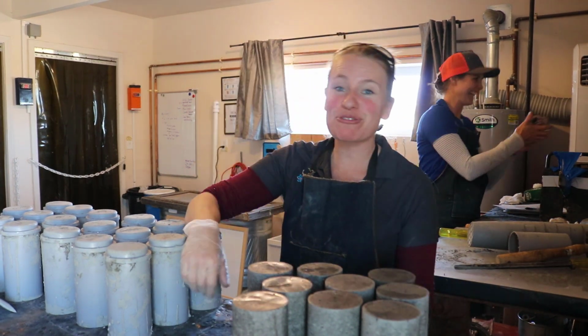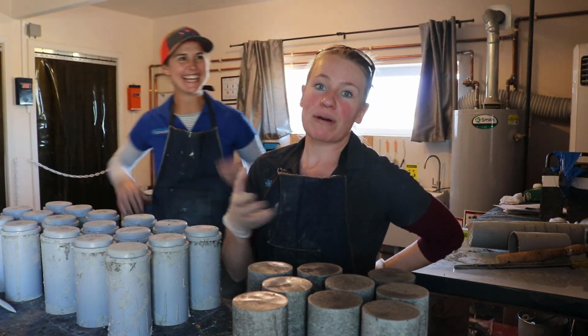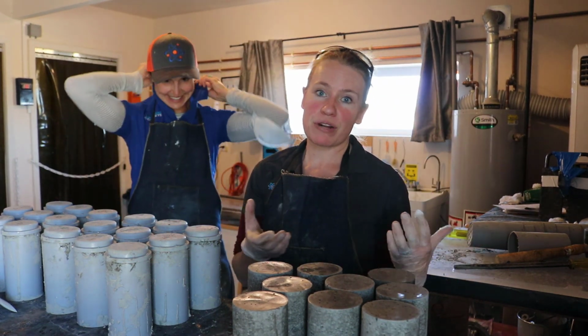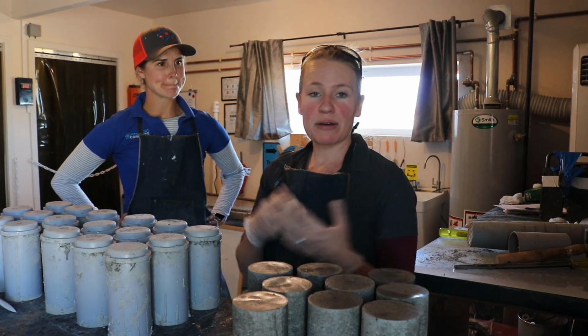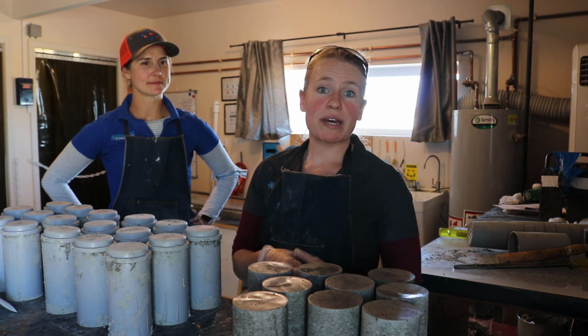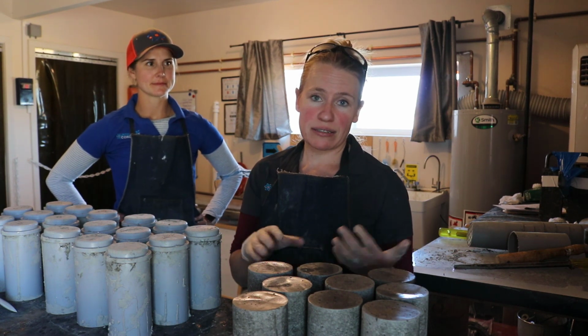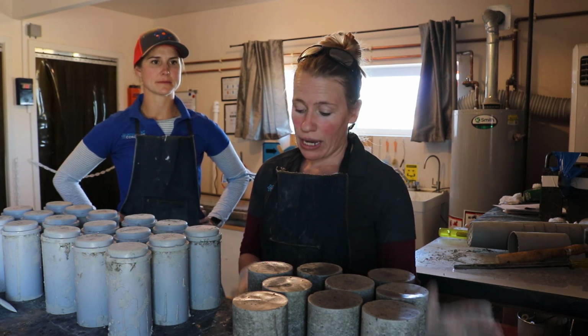Okay, so for your fresh properties, if you have fines in your aggregate, it's going to wind up sucking up a lot of the water that you need for your workability, for your finishing, for your slump, for all that stuff. So it's going to make it a lot more difficult to work with, and then your slump's going to be drastically decreased from what it should be if you had a clean and good quality aggregate.